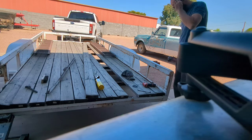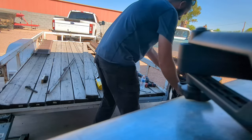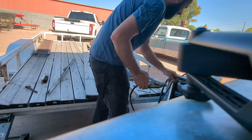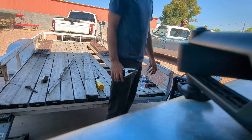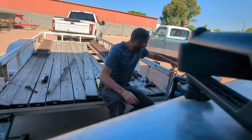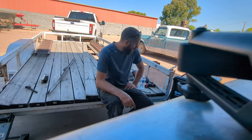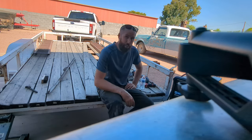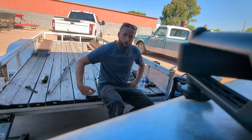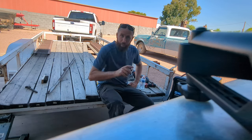Safety goggles — all right, let's do this. I really wish I hadn't sold my welder, because over the last couple of days I've been looking for one just for this project. These things are expensive — you can't even get a used gas welder for less than like six hundred dollars for a good one. It's crazy, but luckily I've got friends with welders. I'll throw some welds across the top here, clean up the bottom, throw some welds across the bottom — not all the way down, just every six inches maybe an inch and a half or so.